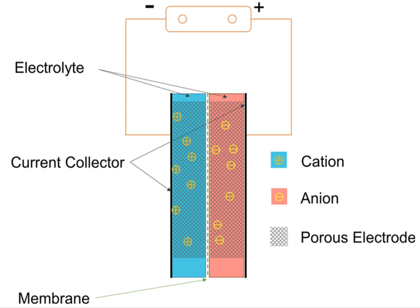They enter the negative electrode and flow through the external circuit to the positive electrode where a second double layer with an equal number of anions has formed. The electrons reaching the positive electrode are not transferred to the anions forming the double layer, instead they remain in the strongly ionized and electron-hungry transition metal ions of the electrode's surface. As such, the storage capacity of Faradaic pseudocapacitance is limited by the finite quantity of reagent in the available surface.